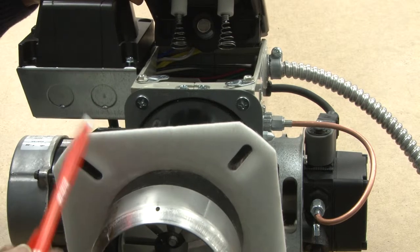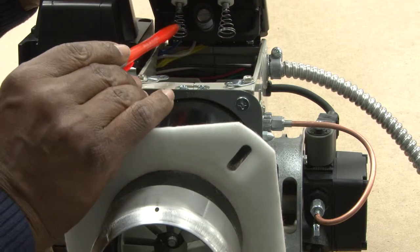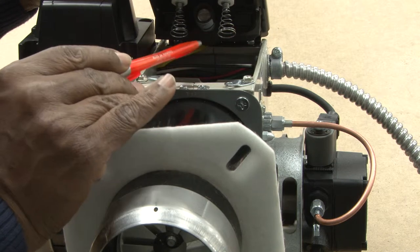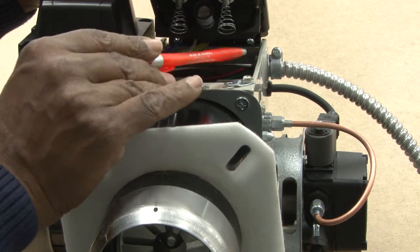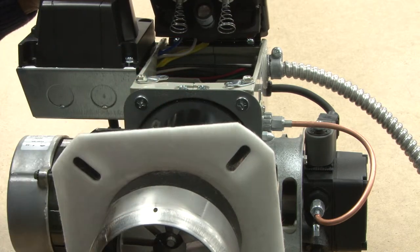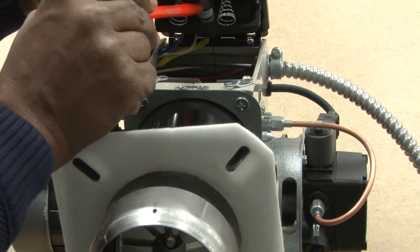The second part shows you a better picture of these springs which are coming off of the transformer to make contact to the electrodes. Basically it will rest on top of the electrodes on the inside to send current through, and at the very end of the electrodes will ignite the oil.